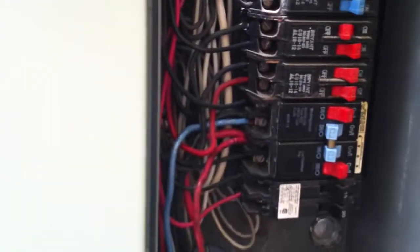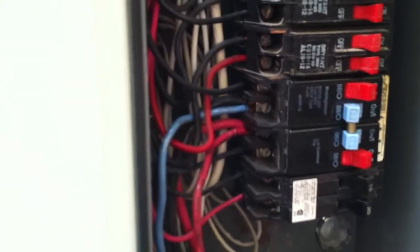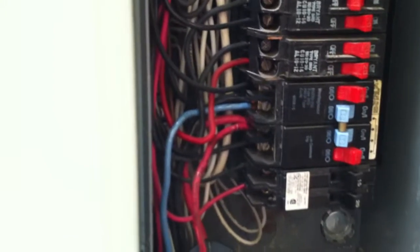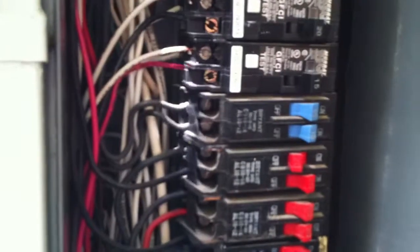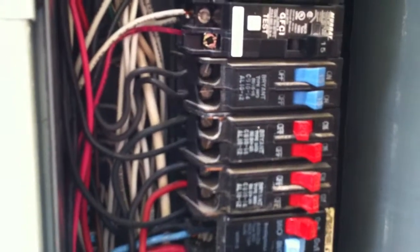We've got plugged into this big cable here — follow this cable around — that plugs into this socket right here. Follow those wires and we go up to the leads to the breaker that feeds the air conditioning condensing unit. That breaker is off. The thermostat is on and is calling for cool, but the FAU unit is also off, so the contactor on the air conditioning unit is open.